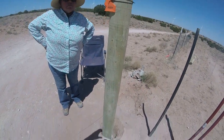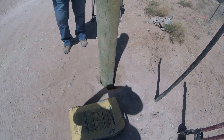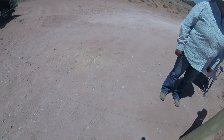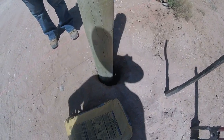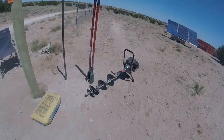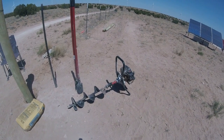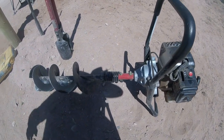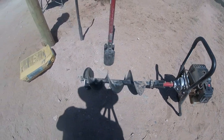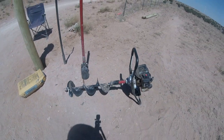What we're looking for for a gate post or a corner is at least 30 inches of depth, which is what we have here approximately. 32 to 36 inches is awesome. We're in rocky country, as you can see. We got down about 30 inches and hit a solid level of shell rock and couldn't chip it out anymore, so we're close enough and we're going to set this post. Here are some of the tools we use. We have an auger — we actually picked this up at a big box store. I like this spring kickback feature; it won't hurt your shoulders and arms as bad. I have had it kick completely out of my hand. The rock has really worn down the blade, just working around the homestead and other places.